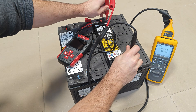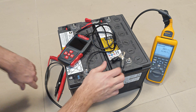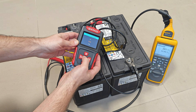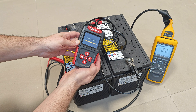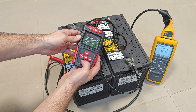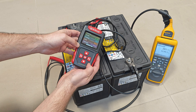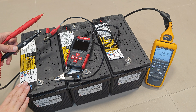Let's continue with the second battery, which is in really bad condition. Fluke shows 381 mΩ — the voltage looks perfectly fine but the internal resistance is terrible. Let's see what Ultimate Speed shows. After charging, the state of health is 0%, the measured current is 25 amps. There is a huge difference here between Ultimate Speed and Fluke, and a huge difference in the internal resistance: 117 mΩ according to Ultimate Speed versus 381 mΩ from Fluke.